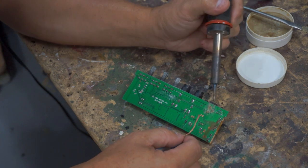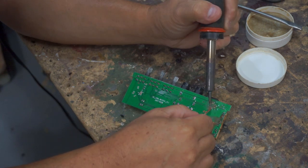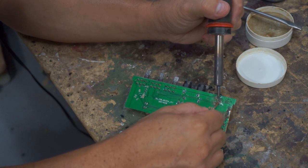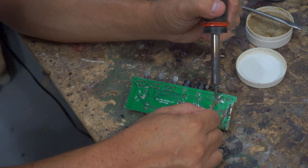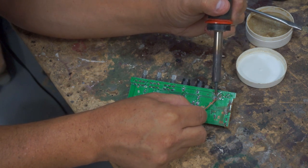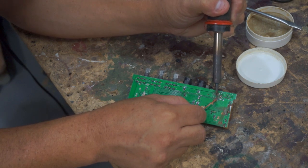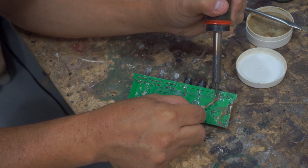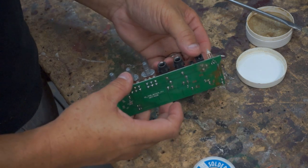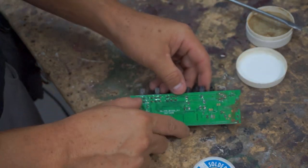Now I just heat it up, put some of the solder wick on here, and then it becomes a wiggling job — heating it up. With three points of contact it's sometimes harder. Since I can't pull this all up, I do have a desolder bulb — maybe we'll try that. What I'm pulling off is the 12-volt barrel, so we're going to use a 12-volt plug from some household electronics we're repurposing. It puts out 12 volts — probably from a router I had.